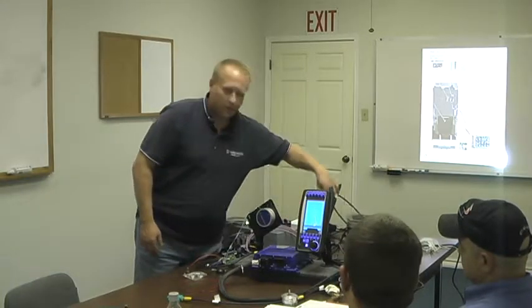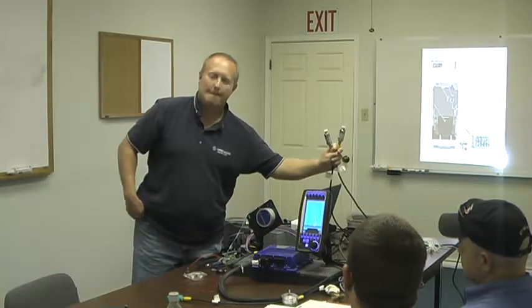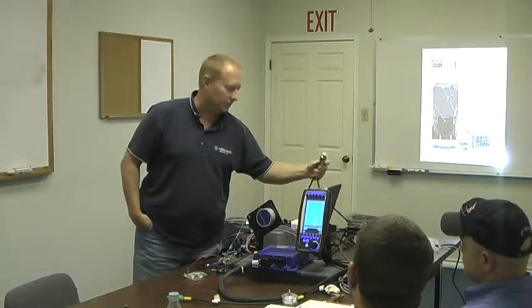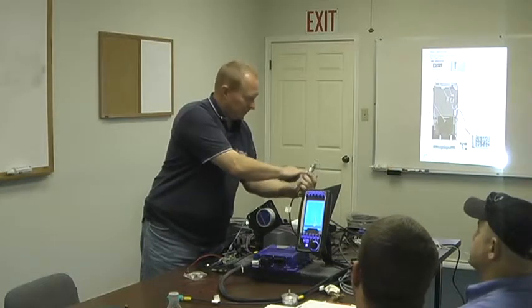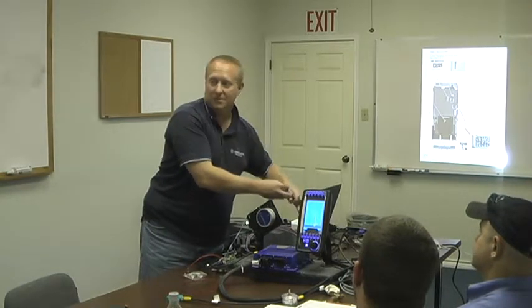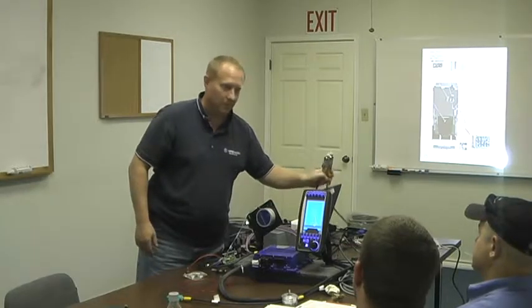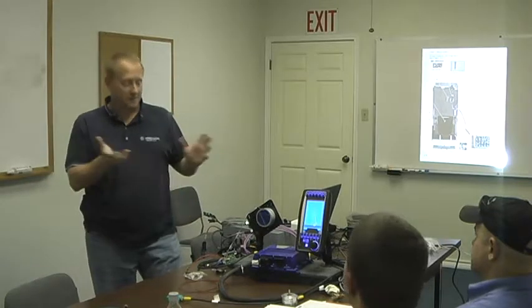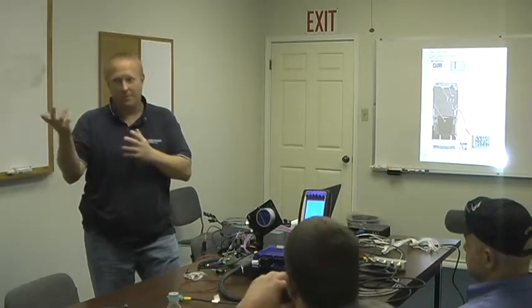Did we go back to individual transducers on? Okay. Yep. CAN transducers, individual. They're actually ID'd separately and they'll be labeled piston and rod. 6162 is the CAN ID. Outside that, that's the exact same stuff that you could potentially see on a Mentor.